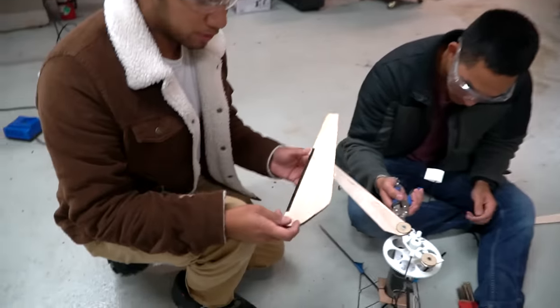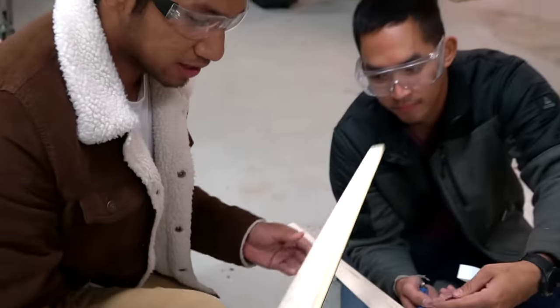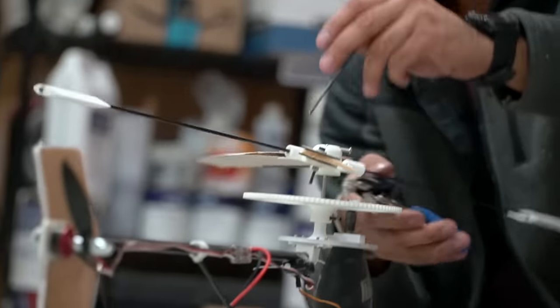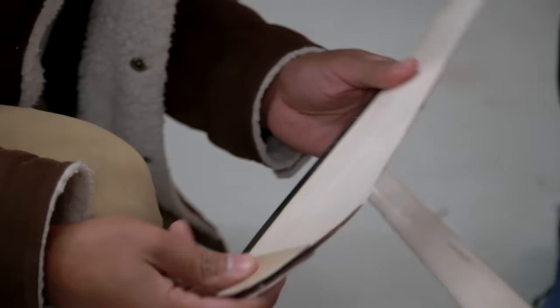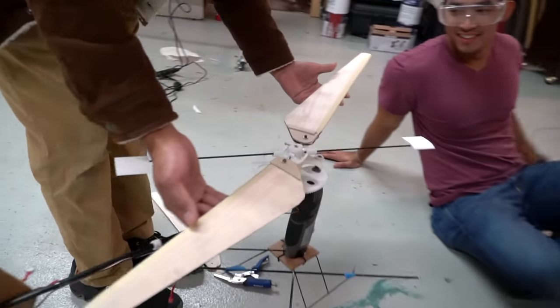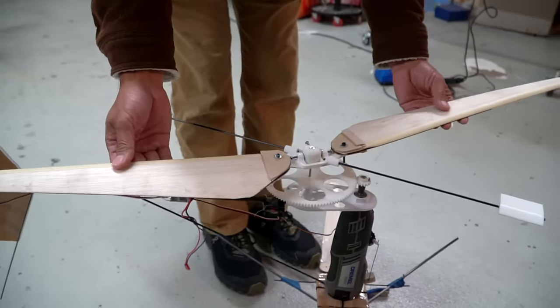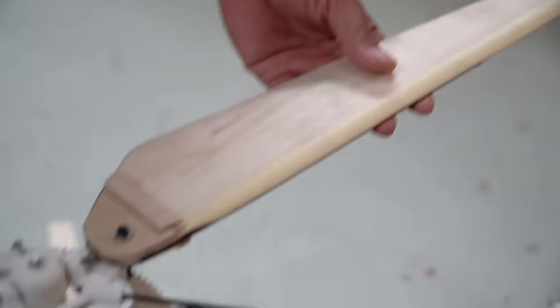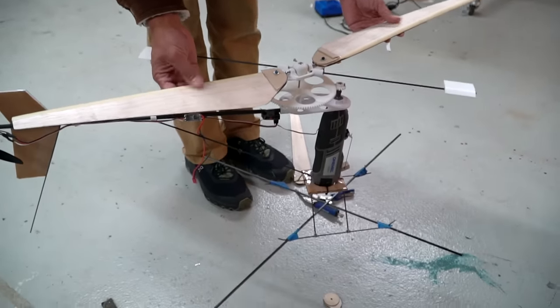Okay. We previously destroyed these really thick blades because the fly bar wasn't strong enough, so it collided with the helicopter boom. We're gonna try to reinstall these now with the carbon strip, and hopefully we see some different results. So these won't break, hopefully. There's also a lot more meat on these. Those other blades, I kind of depend on them to turn a higher head speed, where these will have a lower rotor head speed, so hopefully there's less stress on these big fat ones too.